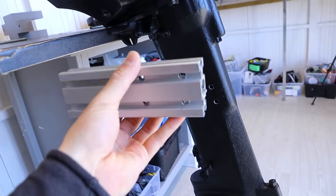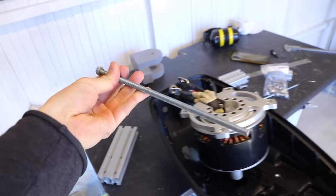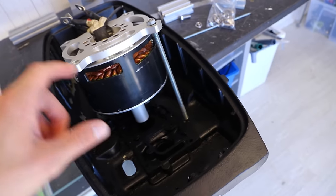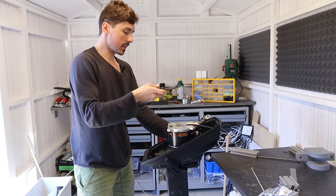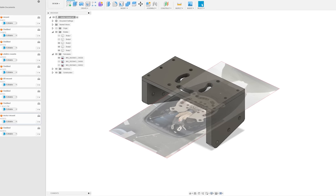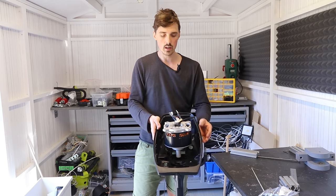I've completely changed how I'm going to mount this motor. I drilled holes in the aluminum extrusions, which work well, but a threaded rod won't line up on all four mounting holes — there are too many odd protrusions on the housing making it very hard to pinpoint where to drill. What I'll do instead is snap a photo above the motor, import it into CAD software, and make a mount that joins the sides of the metal housing. A U-shaped 3D printed holder for the motor should be easier.